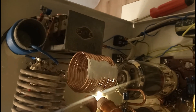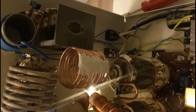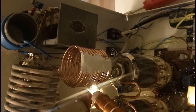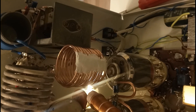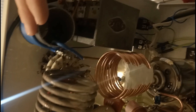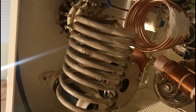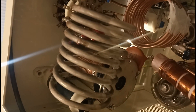On the other part of the amplifier you can see, as usual, 3 coils perpendicular to one another for the Pi-filter. I always use this configuration to prevent discharges on the band switch. If the coils are in the same axis, you will have flashes and discharges, and you are risking to destroy the band switch. So to prevent any discharge, it is better to use those 3 coils. This is the coil for 80 meters, the 3.5 MHz band. This is the coil for 7 MHz and 10 MHz band. And this big coil on a silvered copper pipe, built on Dacia brake system copper pipe, is covering between 14 and 28 MHz band.